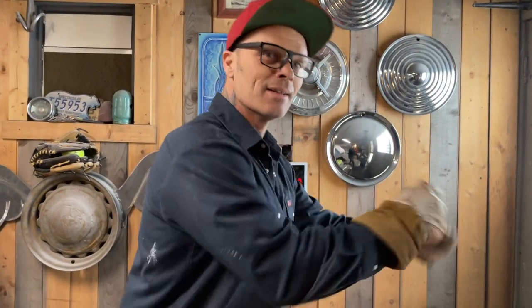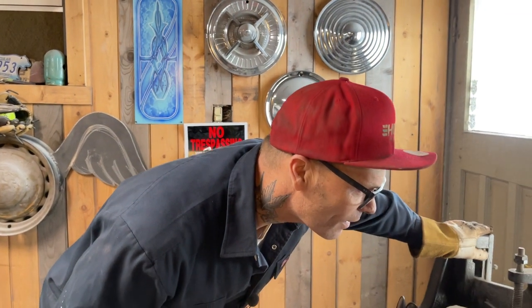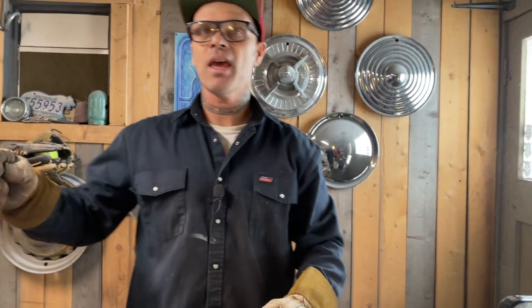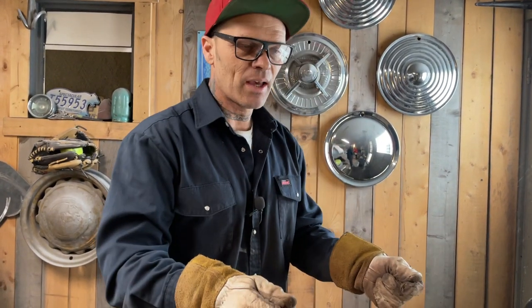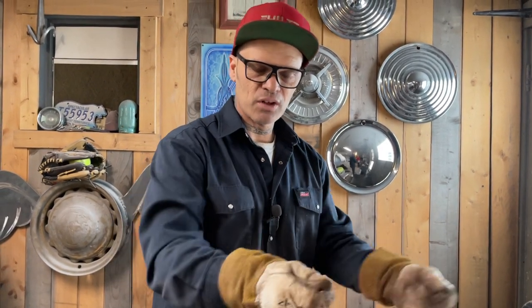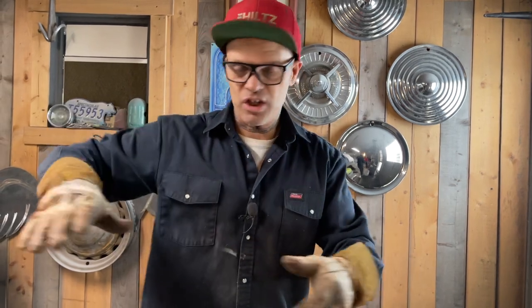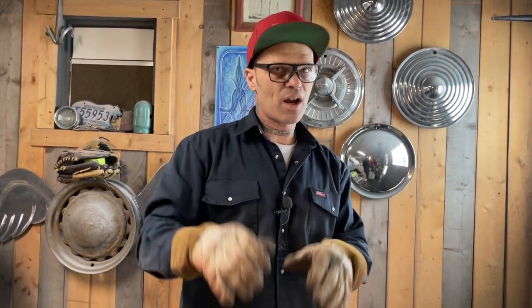Whether it warms or not, well, I guess that depends on how fast you want to wheel it. And it does make the metal stronger because you are applying a shape to it. If you took a flat piece of metal and put it through the English wheel, you'd see me try to push down on that, a lot of strength there. So it does strengthen it. You're stretching it and strengthening it.